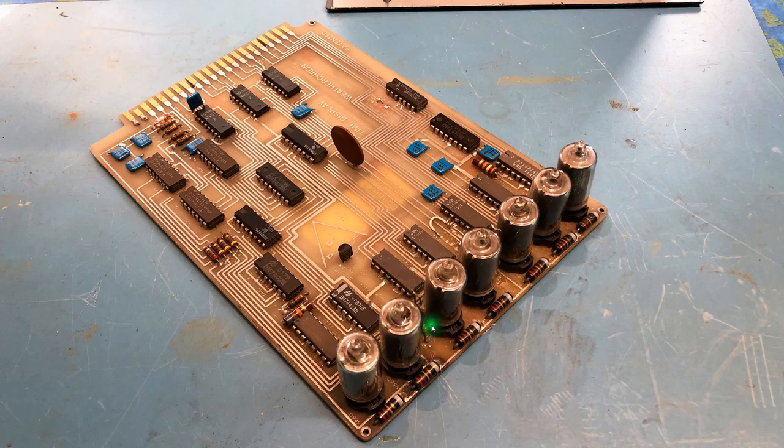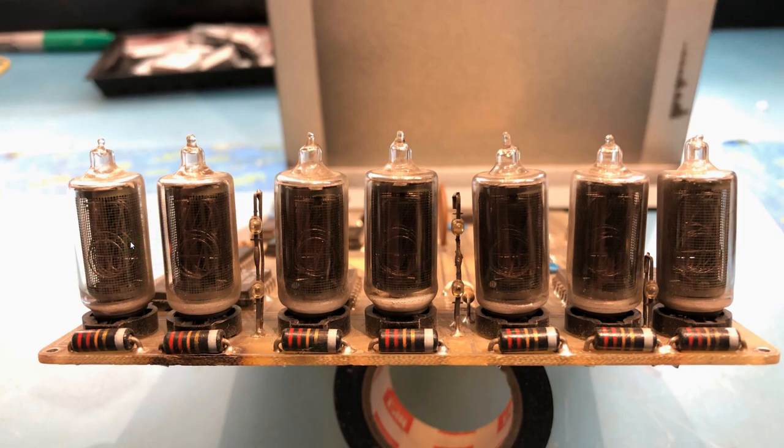You can see again the seven tubes, and if you look here you can actually see one of the colons — there's a little wire-mount loop that's got two display elements in it. They look to me like really early LEDs, though I haven't tried a diode tester on them. Another person who looked at it thought these were miniature nixie lamps or miniature neons. We'll get a closer look in a later photo. Looking at the tubes head-on, there's a little square die inside those colon indicators.